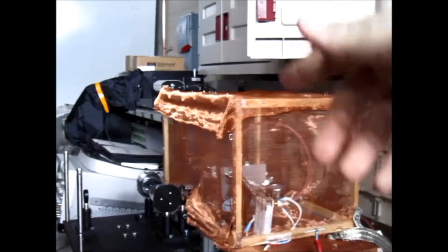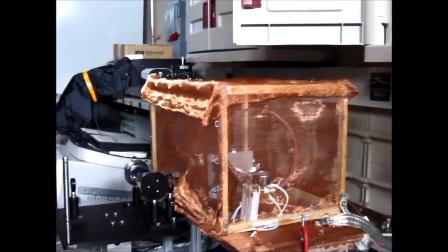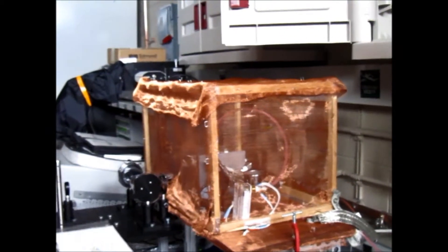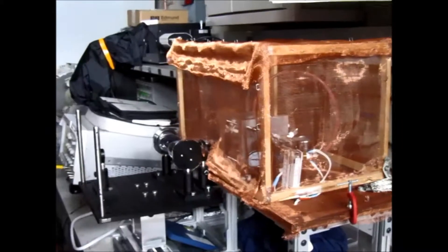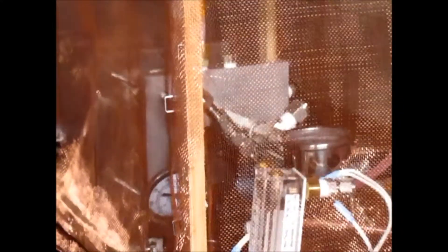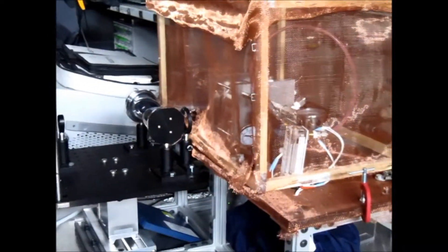Would that work with things like a Tesla coil or other places where high voltages and high frequencies are involved? Here we're creating a specific discharge which is very, very rapid — not even a second in duration. We're trying to study the basic properties of ionized gas on this type of discharge. Because we have this very rapid pulse, it creates a lot of electromagnetic interference that even interferes with the oscilloscope or the computer. That's why we use the shielding.